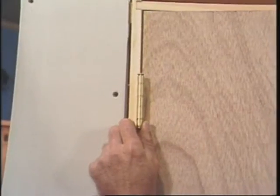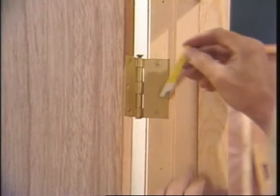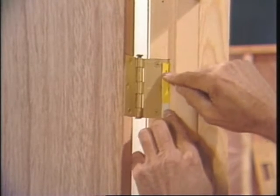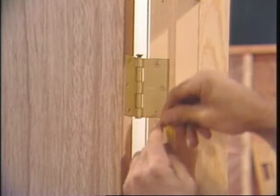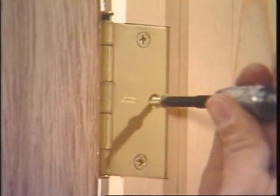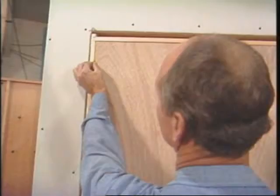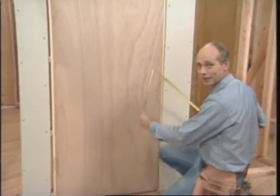That's pretty tight, but it looks like this hinge is sagging. There's some movement on that pin, so I'll take that out by throwing the hinge. Just a little piece of cardboard shim that came from the box the hinges were packed in. If I take this leaf loose and put the cardboard in this position, it'll move the barrel that way, and if I put it over on this edge, it would move it the other way. I'm going to put it behind here to close this margin up. There's a dime, and there's the nickel. The lockset is next, and that's 34 to 36 inches off the floor — I'll make this one 36 inches.